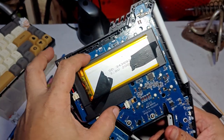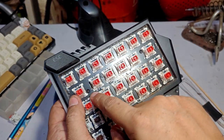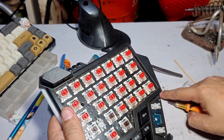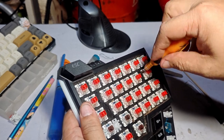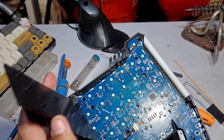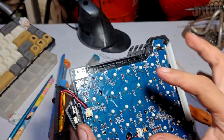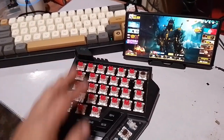We will now do the rest of the switches. To access this part we need to remove the battery and its holder — there's a screw here, unscrew it here, here, and here. Move the battery out of the way, remove the plug, and you can now access the upper part. The Millmax is already installed so let's test it.